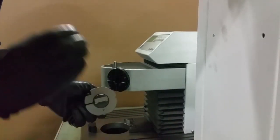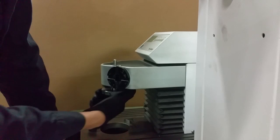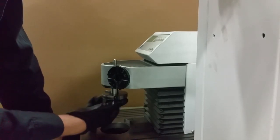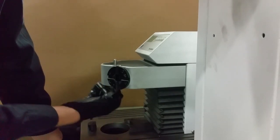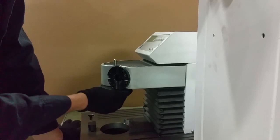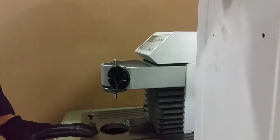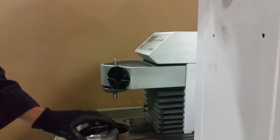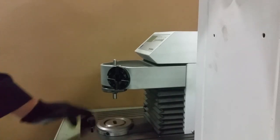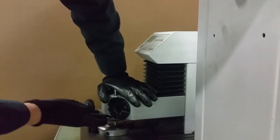You can verify that you did it correctly by putting the punch with alignment ring into this holder. There is only one way to put it in there — you have only one option, because in any other degree it won't lock; it locks only in the correct position. Now you want to verify that the punch will go into the die without any collision. Take your die, and here also there is one notch and one pin — only one way. Once you press on the top part of the quick set and press it down, you can see the punch nicely slide into the die.